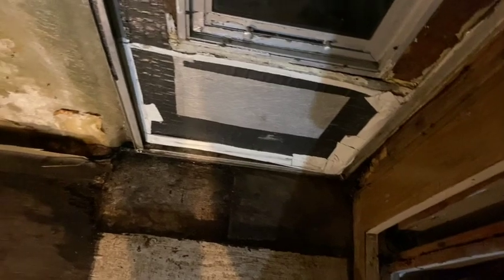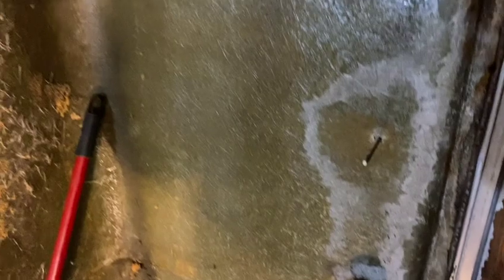There is a lot of rot right down here, so I still have to do parts of the flooring repair. There's a wood piece that goes up in here that's probably rotten as well, so I still have to gut that part. Obviously gut the door too because it's completely rotted. I'll probably put an on-demand water heater here and then use this vent pipe hole for that.